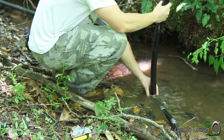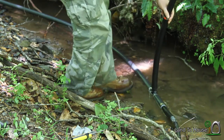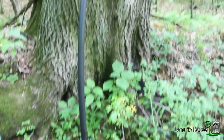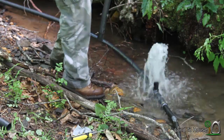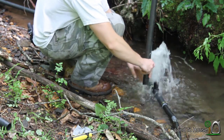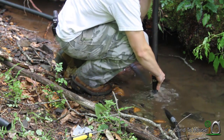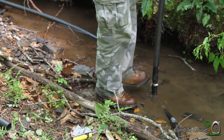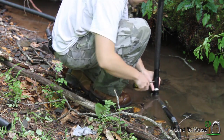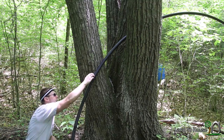This may be too many feet of head for this pump. Let's cut another piece. Now I have a piece of pipe that's about 15 foot long, and I'm just going to use this. So it'll definitely not go above this — and if it does, wow. That seemed to stop it. Now I just tighten this down. So to test where this water stops at, I'm going to tap the pipe right there.